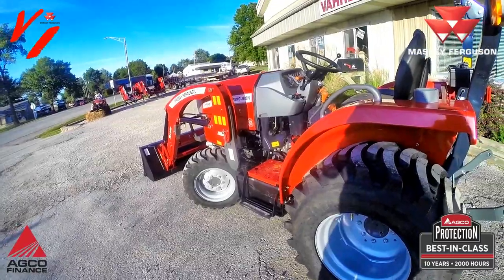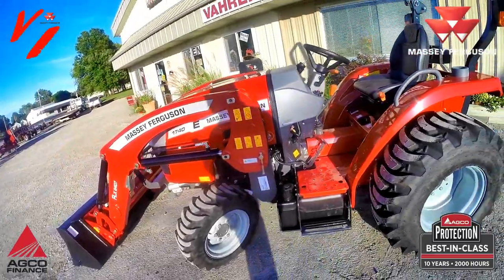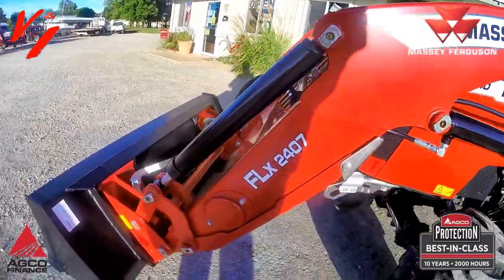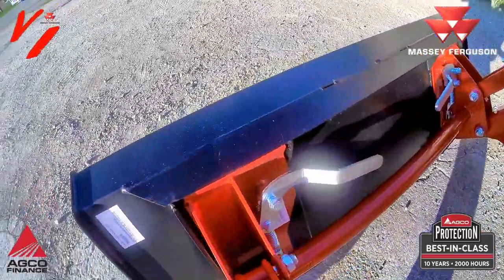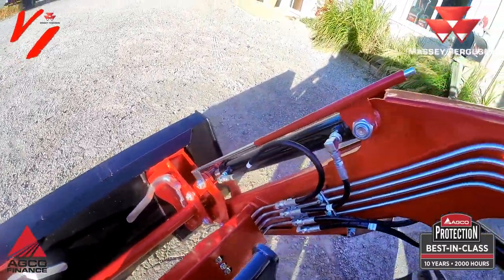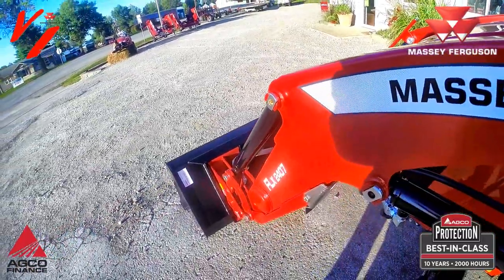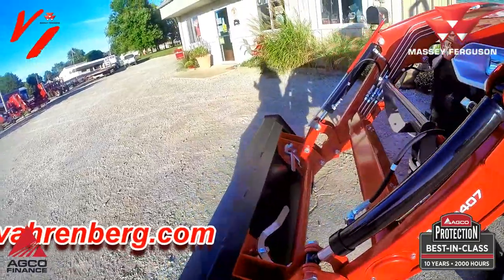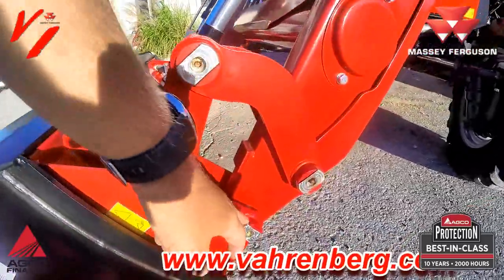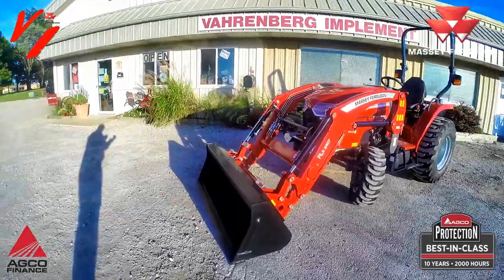This tractor's base weight with no loader is approximately 2,877 pounds. It's fitted with the FL-X 2407 loader with optional skid steer quick attach, which we pretty much order on all of our loaders. Bucket gauge rod is standard equipment. Optional is a solenoid third-function control available from Massey Ferguson. This tractor will lift 1,450 pounds at the pivot pin to a lift height of 94 inches — and we'll fire this tractor up and show you just how high it lifts.